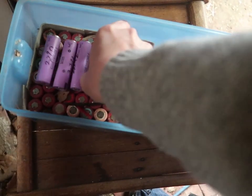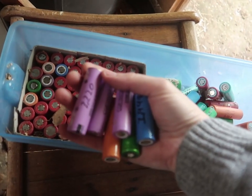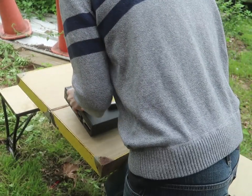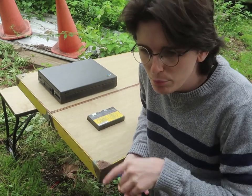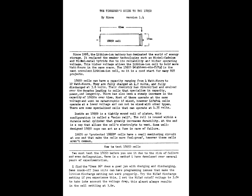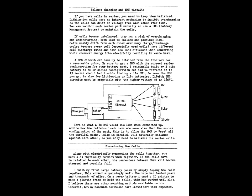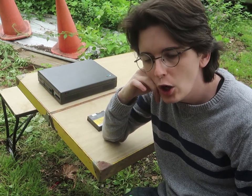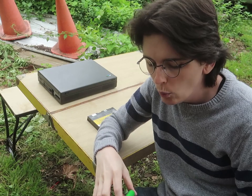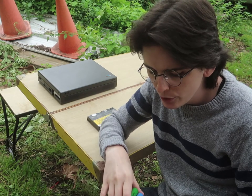I went through and I found 6 cells that are roughly 2,000 milliamp hours of capacity. I made a little guide, a little several page booklet called The Tinkerer's Guide to the 18650, which I'll link in the description down below, but it goes over how to test these. Suffice to say, if you find these cells below 1 volt, don't use them, because I had a few issues where a few bike batteries almost blew up on me because of those cells. Once they are found so low, they're likely to explode on you or go full short.